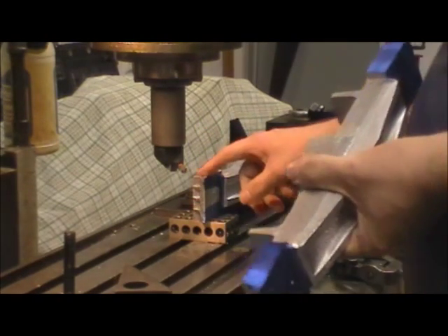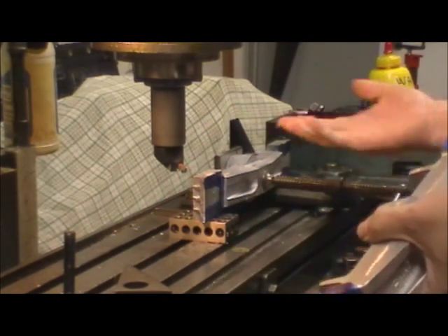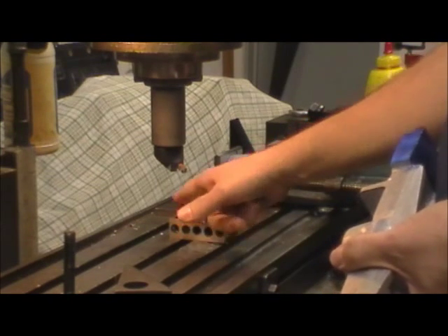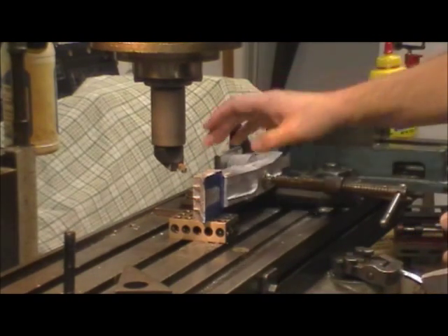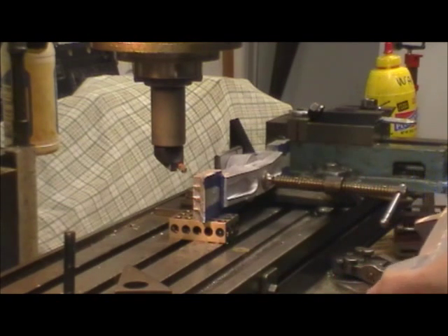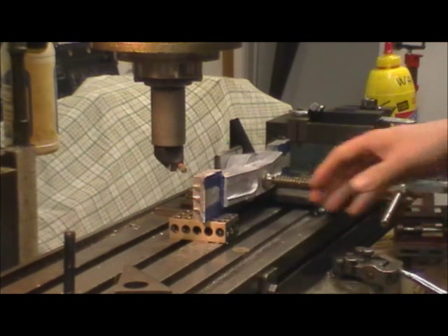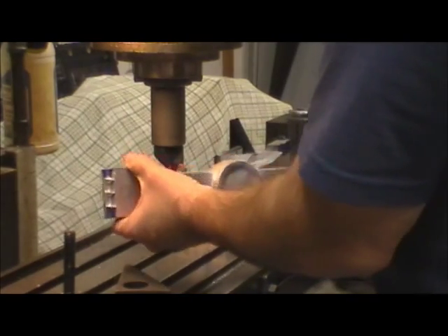So we're going to take this down. Same as before, I have the fly cutter referenced from the deck, so I know where I am in relation to the deck — another inch up on my one-two-three block. I'll take cuts off both sides: I take a cut here, flip it, move down again, take another set of cuts, then measure, and get it back trying to center over the bolster — how much I need to go — my final cuts coming in splitting the difference over the two, taking it down to two inches across the surface. Seemed to work out pretty well when I did this.